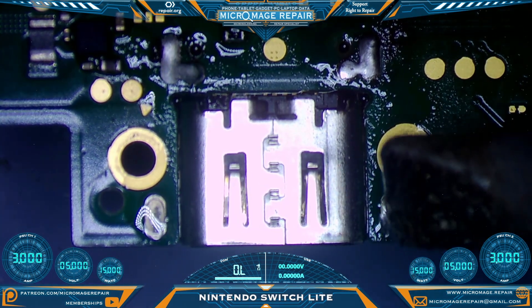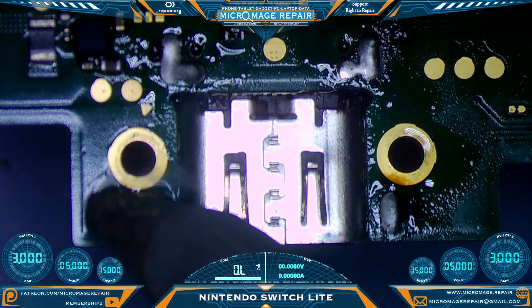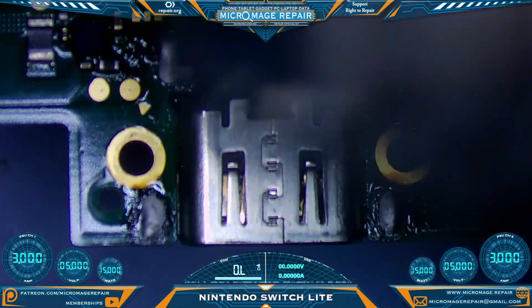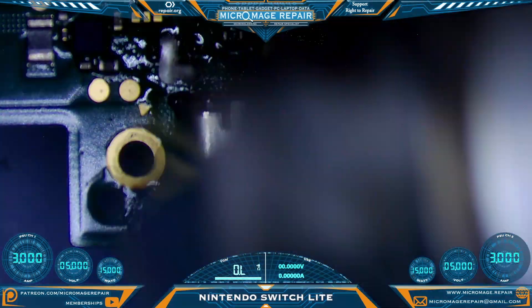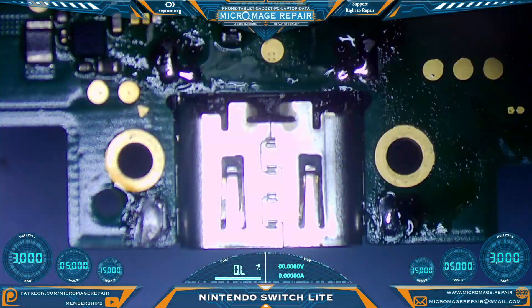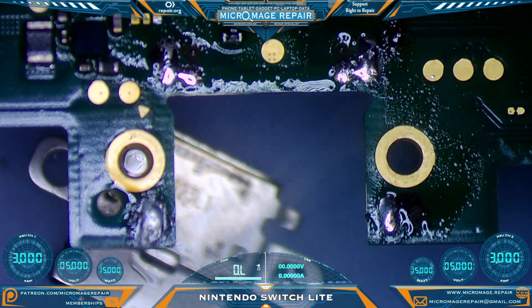By mixing it into the solder, it turns it into low melt solder. You will probably find stick solder easier to use — I've gotten rather used to using this. We'll begin by wetting the anchor points, and they will wet fairly quickly with the low melt mixed in. I want all four of them wetted, then I'll concentrate on the pads, and it will drop right off. Nice clean pull.